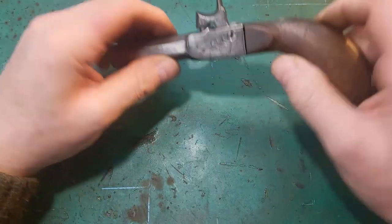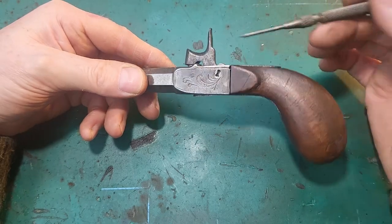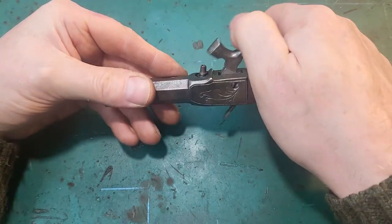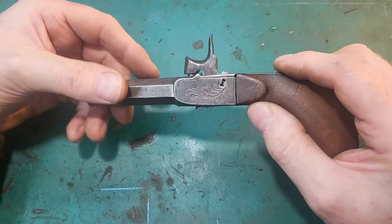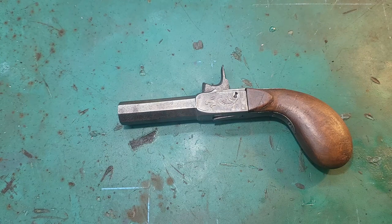The pistol is back together now and I'm very pleased with it. Easy fix on this pistol - just making sure that the spring doesn't move, replace that screw, hardened it and added the nut and some thread lock. Hopefully it won't move again and it's all in working order. Overall very pleased with that quick easy fix, and the gun looks a lot better now it's been cleaned and maintained. I hope you enjoyed watching this repair video - if you did, please give it a thumbs up and consider subscribing. Thanks for watching.